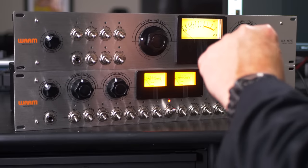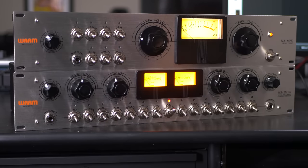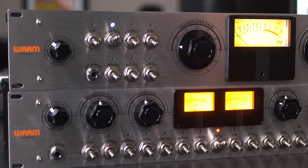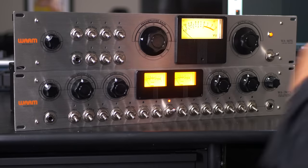Continuing on, we have a bank of seven switches. First is 48-volt phantom power for microphone level signals if you're using a condenser mic or an active ribbon. Next up is the high gain switch, which adds 20 dB of gain by adding that third tube into the circuit. With the first two 12AX7 tubes we get 70 dB of gain; flip that high gain switch and we've got an additional 20 dB coming from the 12AU7.